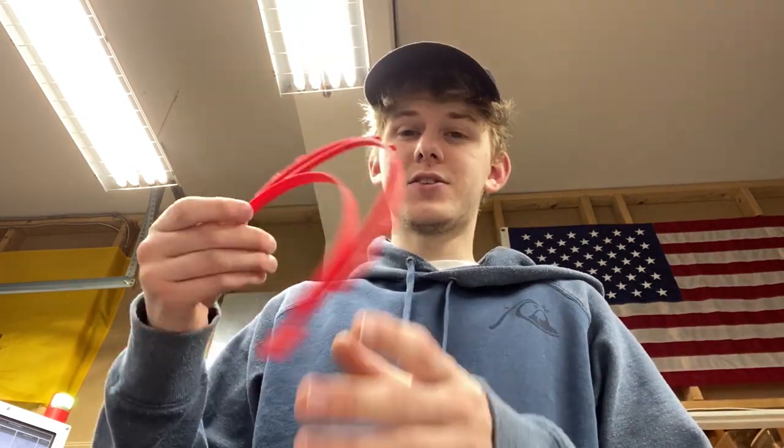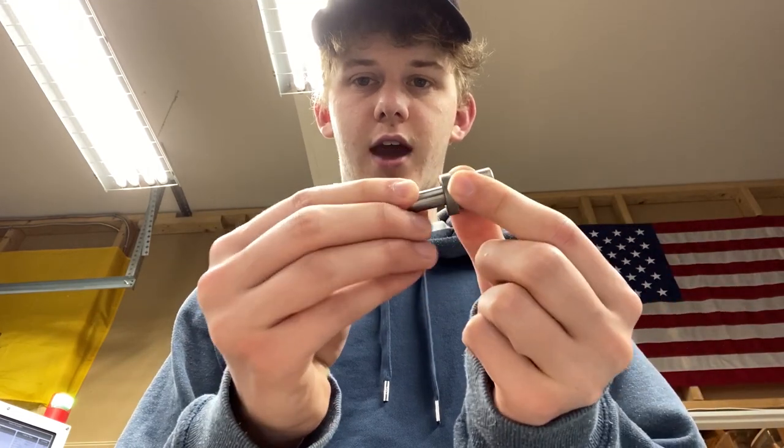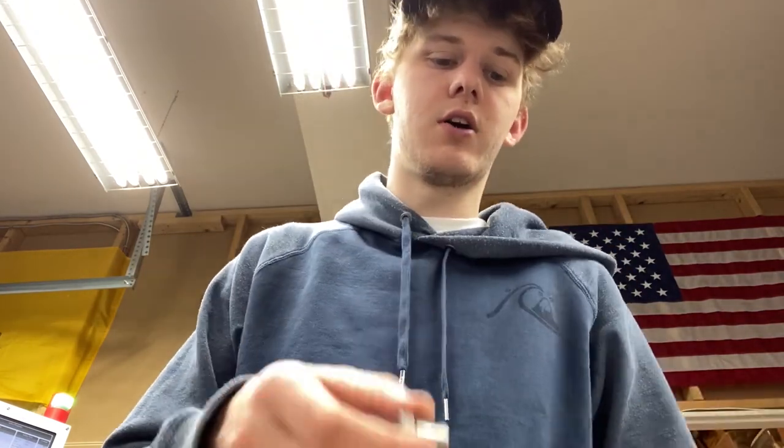This stuff adds up quick. This is the part we're actually trying to make — I'll show more of this once we're further along making the mold itself. I've got drill bushings here, and then 3/8" pins that have a really nice slip fit with no slop. These drill bushings are going to be for the actual mold itself — got four of those. And then I've got ten of these guide pins — you can only buy them in ten packs — so I've got plenty, and we only need four.